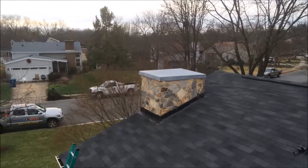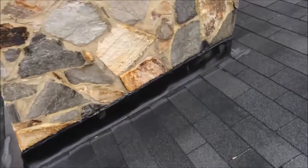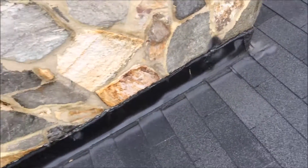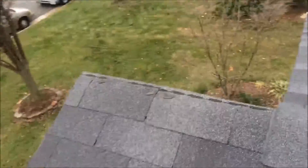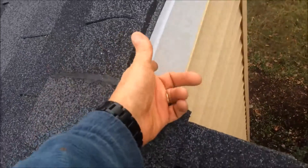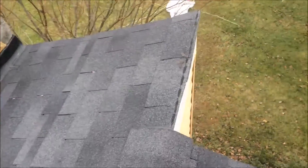That chimney is not in use — they closed off the top, so that's okay. Over here there was a problem and the contractor came back and just put some black caulking right along the edge. So we're going to remove all the shingles completely around the chimney, install ice and water shield, and then re-shingle it. They should have put aluminum drip edge to overlap the fascia and the top, but they just brought it all the way underneath. There's also a large gaping hole underneath, so this will leak from driving rain — we'll take care of that as well.